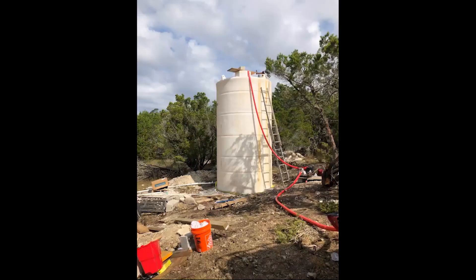For water, I have an unconventional approach. I have a 6,000-gallon water tank that I propped up, and I bring in water from the local municipal water provided by the county — that water is already regulated. I make a couple of runs using a tote on the back of my truck, fill it up, bring it out to the property, and a little pump pumps the water from the tote into the tank. To get the lines to each lot, I just rented a trencher and trenched lines out — and it works pretty well.